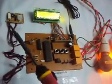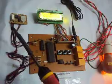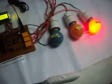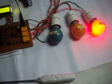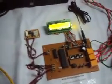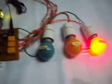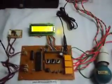Let's vary the temperature of T1 with the help of a soldering rod. I am increasing the temperature value with the help of this sensor. The temperature is now above 36 — it is nearly 51 — so the fan is switched on now. The temperature is slowly getting decreased, and when it goes below 33 automatically the bulb will get turned on.